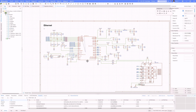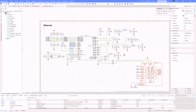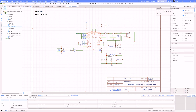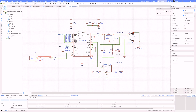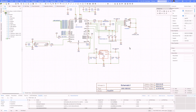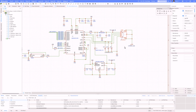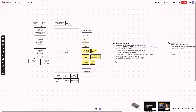I changed the USB-B connection to a mini USB-AB connector, which supports both host and device. I'm using the USB3320, which needs a 13MHz clock and potentially power supplied via the MIC2099. The AB mini connector allows the FPGA/SoC board to act as either a USB host or a USB device.